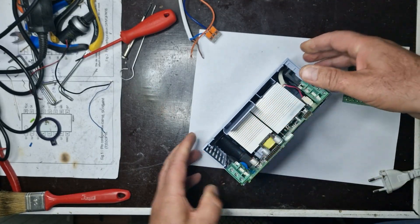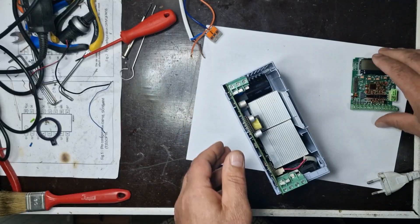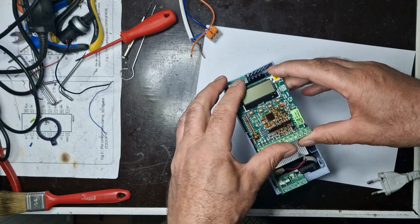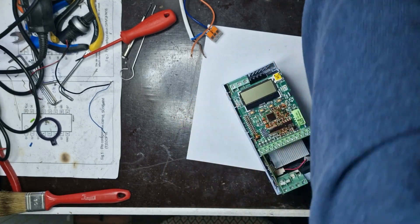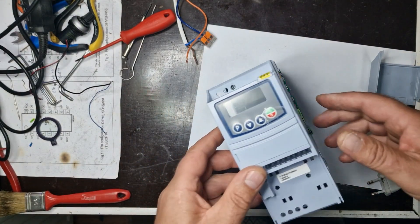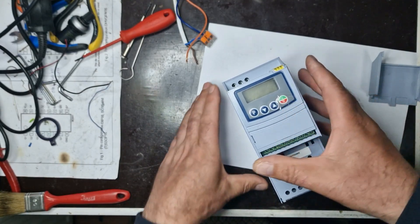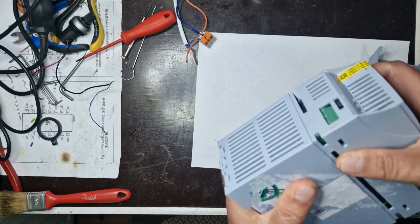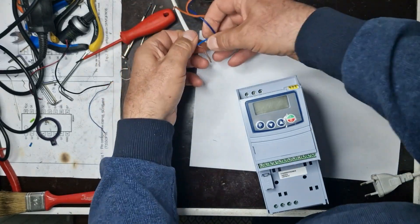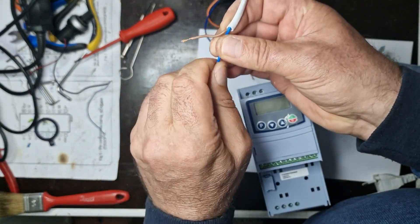Then I identified the faulty component controlling the chopper — it wasn't a MOSFET, but an integrated circuit similar to an LNK304. Additionally, the 27-ohm resistor and the transistor in the feedback circuit were defective. I replaced these components with new ones of the same specifications and received the new NCP1014 IC, which I mounted on the board. After soldering, I cleaned the board from flux residues, checking that all components were within specifications. For the stability of the NCP1014, I added an additional resistor to the VCC pin after the autostart sequence.